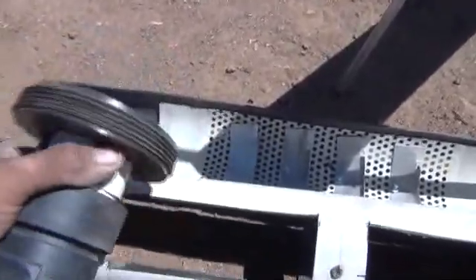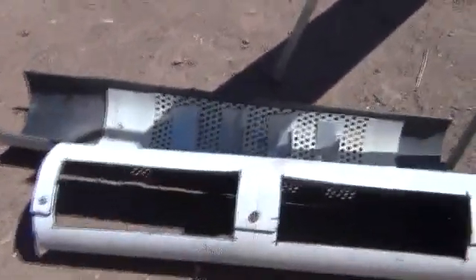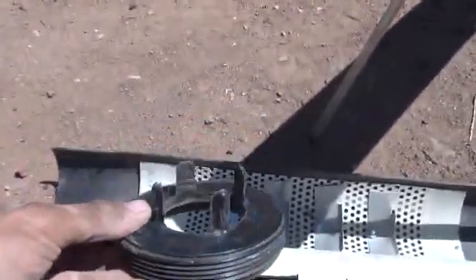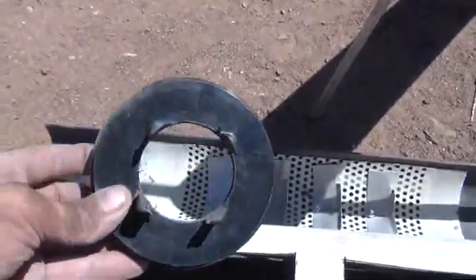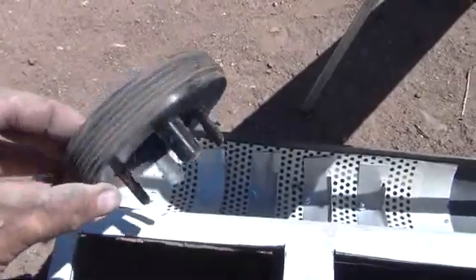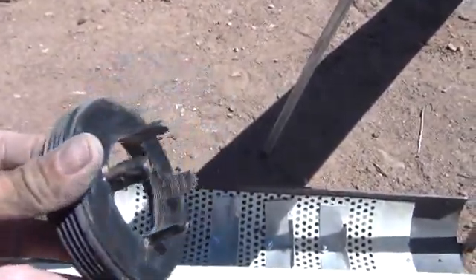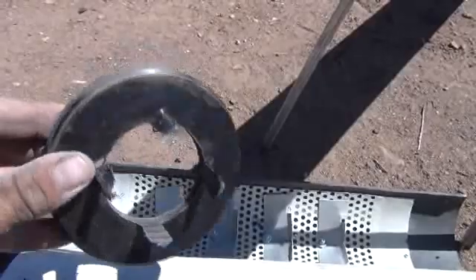Let me go on here to the hose. You can see here it's just the threaded end coupling. I just centered my hole saw a bit and left some tang sticking out there. Those tangs actually fit right up inside the vacuum piece and allow you to thread the whole thing as one piece — works pretty well. They're all about the right size. So that's all it is — pretty simple to do. It was something I came up with just to try to dredge in dry environments.